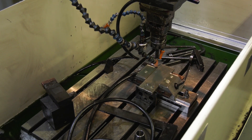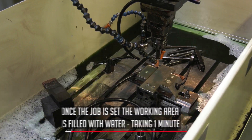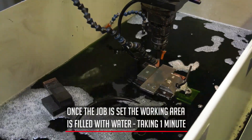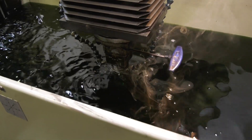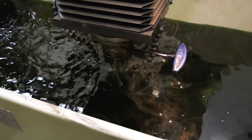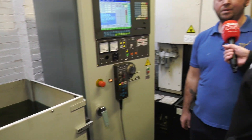Let's see this actually cut the material — that's the key thing that we want to get to. So we're now cutting, Craig. How long is the cycle going to take to do one pass? It'll roughly take about five minutes to profile around the edge of that square, because we're only going half a mil deep on it. And what is the maximum depth you could go on this type of material using this sort of electrode? We do some jobs where we're putting hexes in 200mm deep in jobs, and it's holding tolerances of 10 microns across a 200mm length.